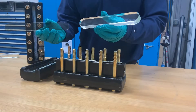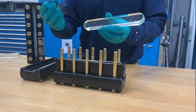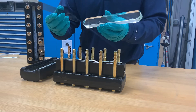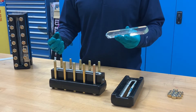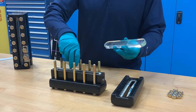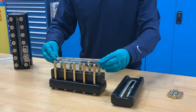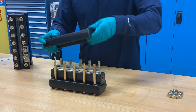The shield sits between the seal gasket and the glass in the wetted portion of the armored glass gauge chamber. Mica should always be held by the sides when building a glass gauge assembly because the oils from your hands can get on the mica and affect performance. This is a disassembled transparent gauge. The mica sits in the wetted portion of the chamber — place it in the recessed surface, then place the transparent glass over the mica and the cover over the bolts.